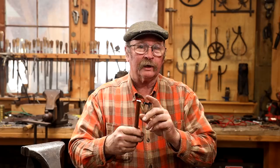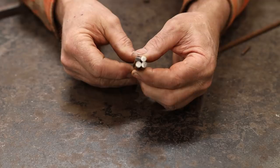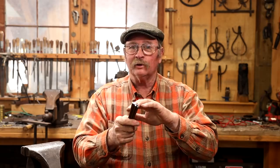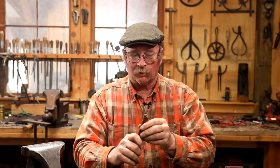In a previous video we looked at making a basket twist handle with just four round bars, and those lay next to each other very nicely. They form a nice square and it's pretty easy to keep them in place while you forge weld it. Today I want to complicate things a little bit by adding a fifth bar, so they need to lay into a pentagonal shape — and they don't want to do that. They want to start to form a little bit of a pyramid, three on one side and two on the other side, and that really is not what we're after.